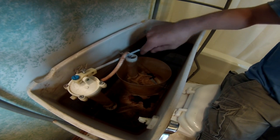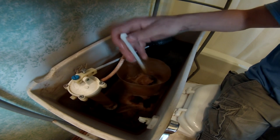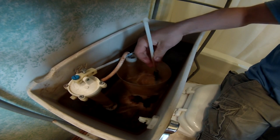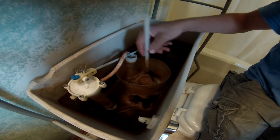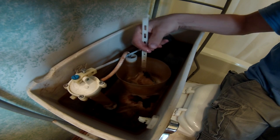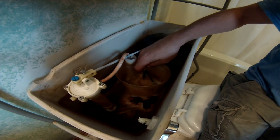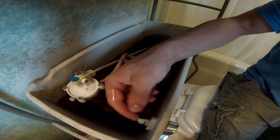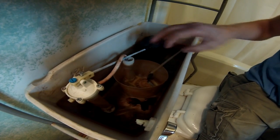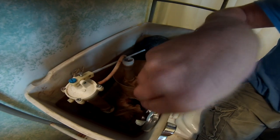This is the inside of the toilet. You've got the inside handle piece right here, and that's what's broken. It includes the chain, which is down below — all twisted up, but it's got a little hook you can take on and off. We're going to take the handle off using an 8-inch adjustable wrench — just fit it on there.